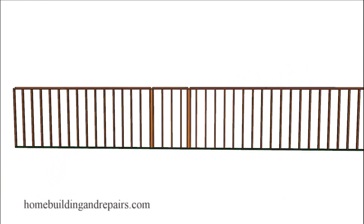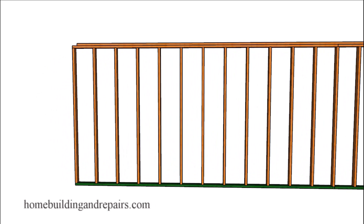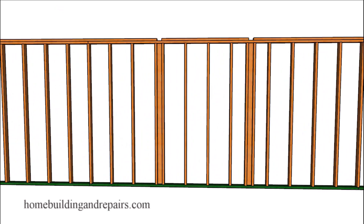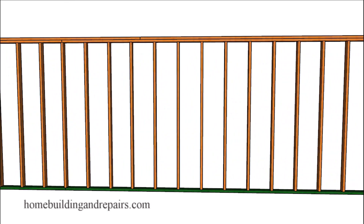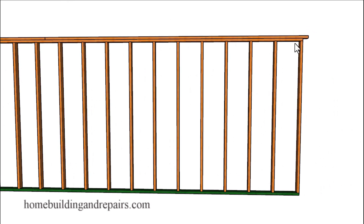Next up is the side wall — this is going to be the longest wall in the house. If you're going to drywall the garage you'll need to install backing for the drywall along with channels and ears. The top plate from the intersecting wall will also go over this wall and fasten to it — wherever you see that lapping over the wall, we refer to it as an ear. Don't ask me why, but we did.